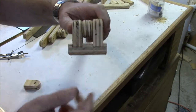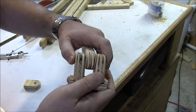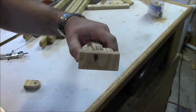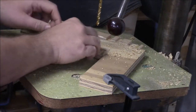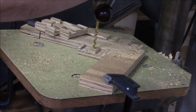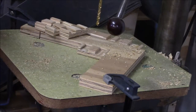Then we can take the quarter inch bolt, pass it through here, and it becomes a nice little pivot point. There will also be a hole here to attach a camera or something else. I've got this wooden block set up so I can just insert the part, bring the drill bit down, and it drills a nice hole right in the center. We're going to be doing four of these — one for each end of the boom arms.